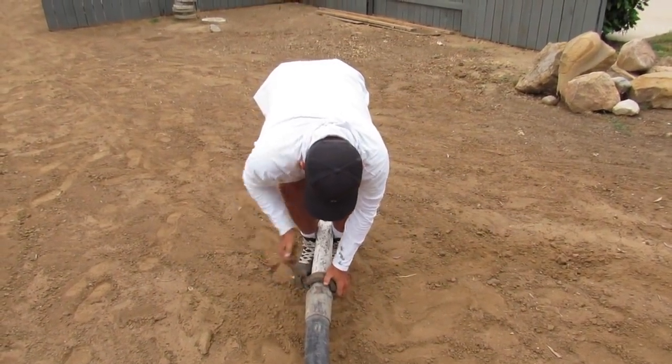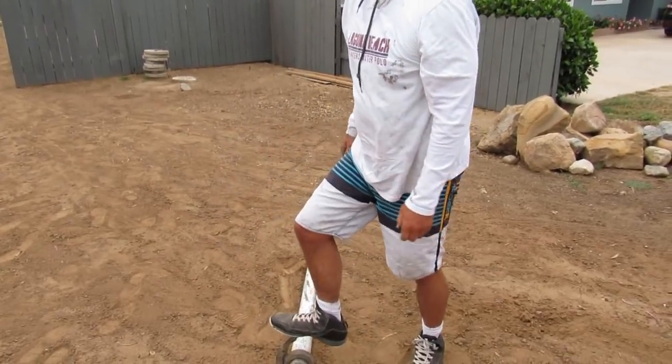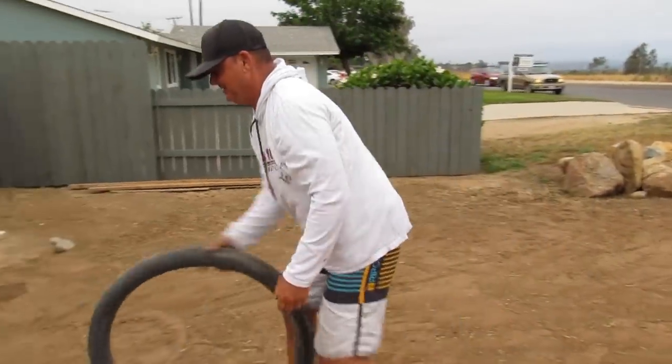From two and a half to two, these are heavy duty clamps. They have big Victaulic clamps with a groove in them, but I really don't like them because they wear out faster. If you're buying concrete hose, heavy duty ends is probably the way to go — that's what I like anyway.